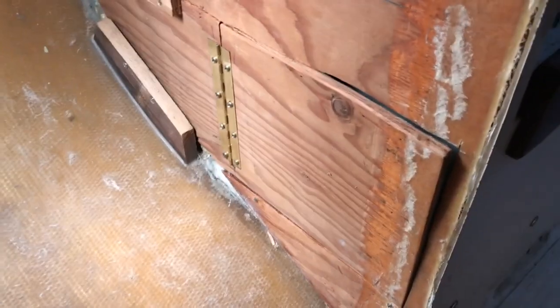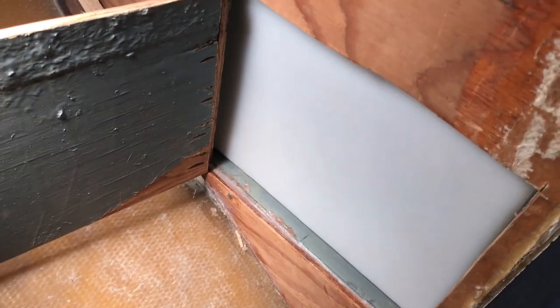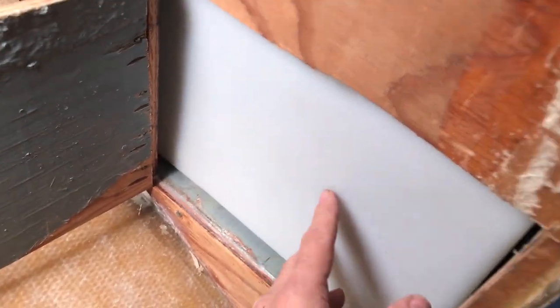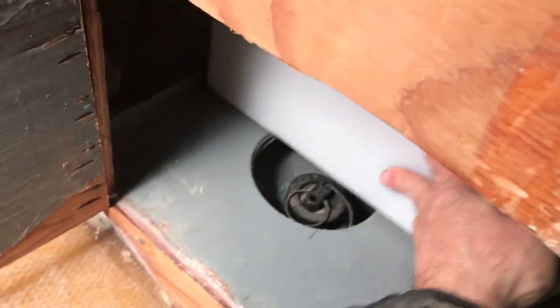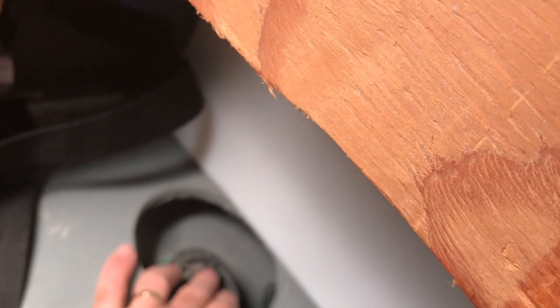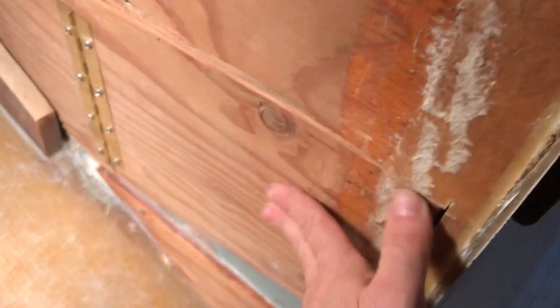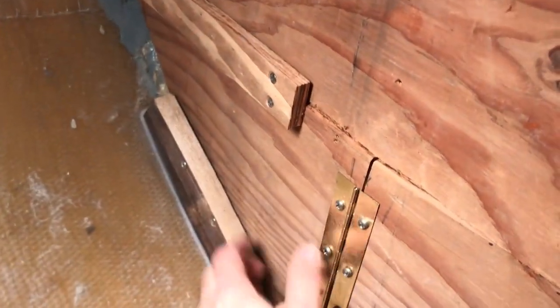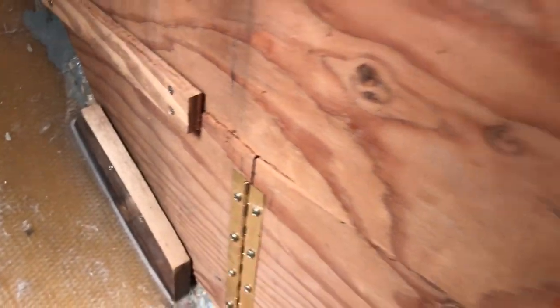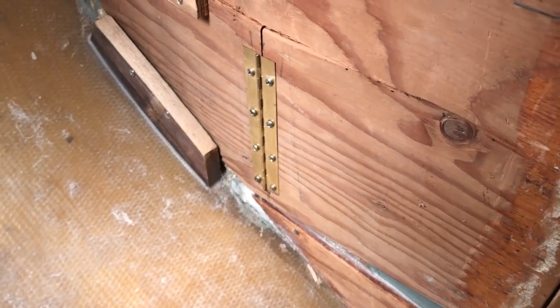For the port side water tank, I've constructed this small door into the bulkhead, allowing me to access the transducer there. I just need to unbuckle the straps from the top. Unfortunately, you can only push it this far, so you can't access this part from the top, only from the side. Also, I have made sure I only screw this part of the bulkhead together. If I needed to remove the water tank, I could easily do that.